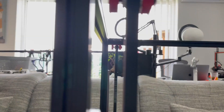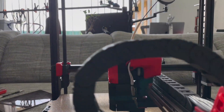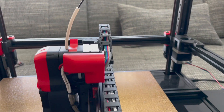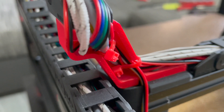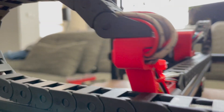The problem with the belts was that they were a bit short, so I had to remove the idlers to mount them and then tensioned them - they're running pretty good. When I wired it I got everything started from the hot end and just went down the chain, unsnapping each one by one, mounting it in there, zip tied it, and brought the XY end stop up into the run as it continued down and around.